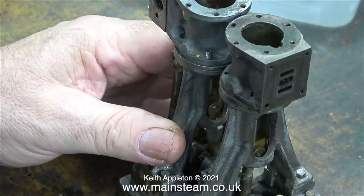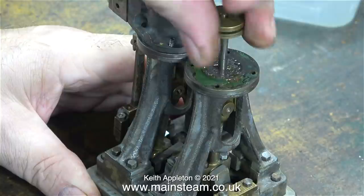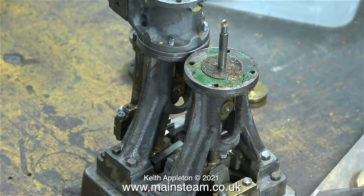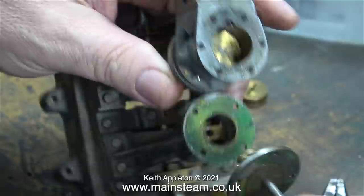By the time I got around to filming this part I was really hoping that these metric-type bolts hadn't been forced into the existing holes. Here I'm breaking the seal between the cylinder and the part that fits to it, which was glued. It took a bit of pressure to remove the cylinder. Here I'm unscrewing the piston from the rod - I really wanted the rod to unscrew from the crosshead but the piston came off instead. When I tried a screwdriver on the top of the piston rod, the roughly cut cross slot just broke off, and I had to resort to a pair of pliers to unscrew the piston rod from the crosshead. These pistons are a bit of a mess; I'm going to make a new pair that takes silicone O-rings.